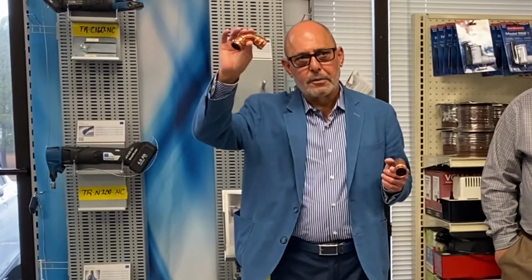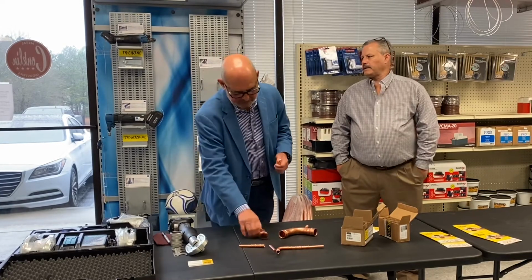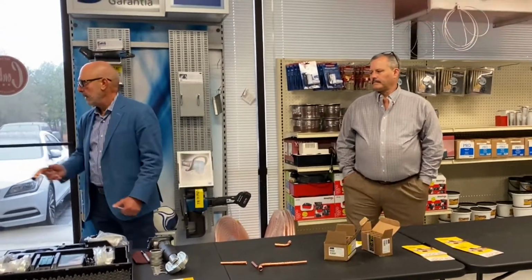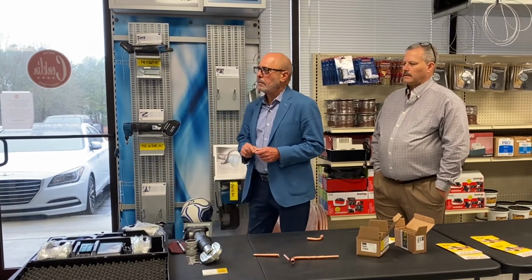And the reason for it, if any of you have seen these fittings for the water applications before or used the fittings, it's a totally different concept. In here, you will do a hexagonal press that actually will deform the tubing inside. The press fitting that you're competing with is a water fitting. Yes, sir. It's essentially, yes. It is this that you're seeing, and this is ours. And this is soft copper, and this is a total hard copper.